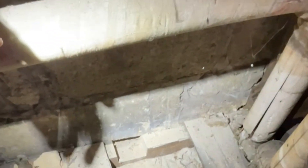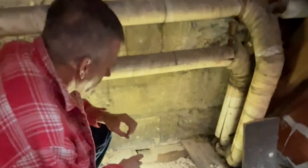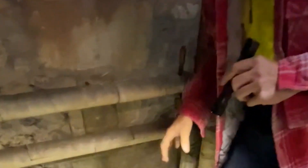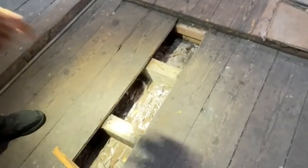Down here on the floor, that's going to be a cable way. I've drilled a hole there, and that's for cabling going into the ceiling space of the first floor. If we need to get power through the floorboards into all the various rooms on this floor, we've started to rip up floorboards. We'll do minimal amounts because we're going to have a pathway. The bearers go east to west, and we'll be drilling holes through the floor bearers or floor joists, teeing off for lighting or power.